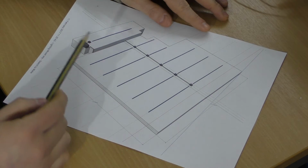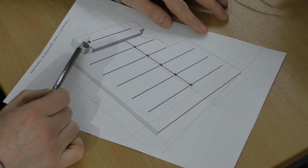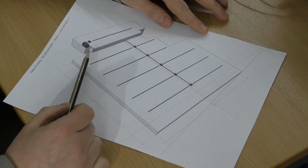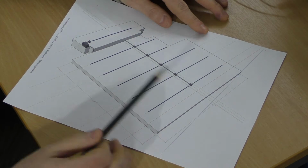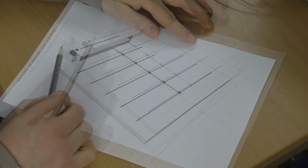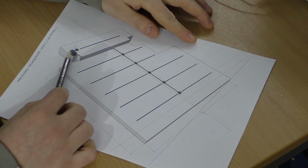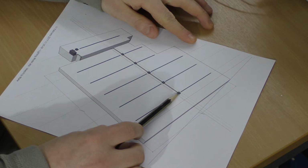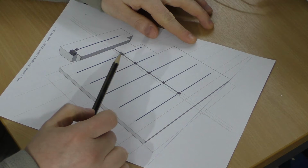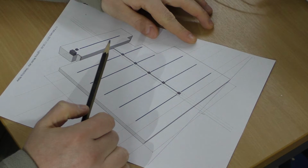If you go online, you'll find voltage drop calculators that will tell you what voltage drop you'll get between, say, a power supply and the end of the cable, based on the cable thickness, the cable type, the voltage, the current, and all the other parameters that matter. If you start plugging in the numbers, you'll find that running 12 volts from here to here with a reasonable voltage drop, it's just not going to happen. For, say, a copper cable, it was coming out something ridiculous, like 96 square millimetres.